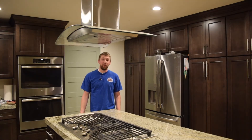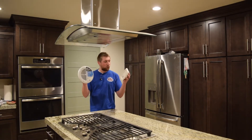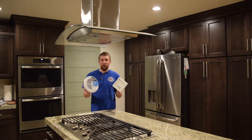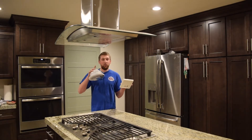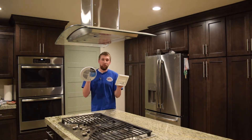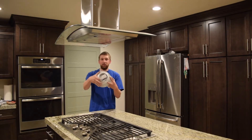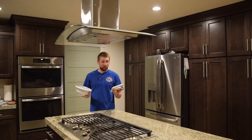My first step in running this exhaust line is my exhaust vent or exhaust hood. I bought two of these not knowing which one was going to work best, and I'll just return whichever one I don't use. My plan is to use the ventilation attic vent that's already up there — I'm just going to cut a hole in it, mount one of these directly into it so I don't have to drill through the roof or the house. Then I'll remount the vent and connect my hose onto the back side. I'm going to hop on the roof now and take it down.